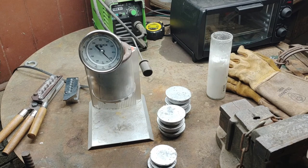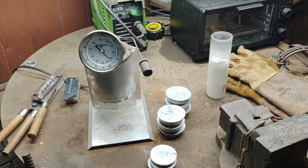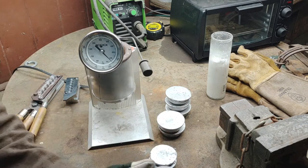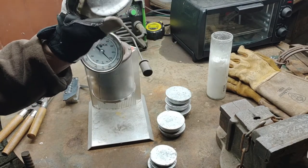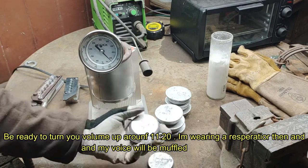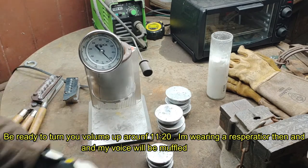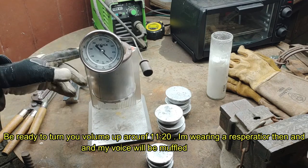What's up guys, we are on part two of the amateur bullet casting vlog and we're actually going to start pouring our bullets now. Last video we made our ingots — these are 100% clip-on wheel weights, or the closest to 100% we're going to get. We made our ingots, fluxed them off, and now it's time to actually pour them out.